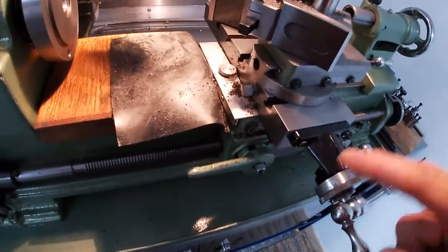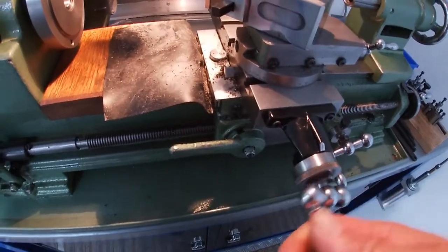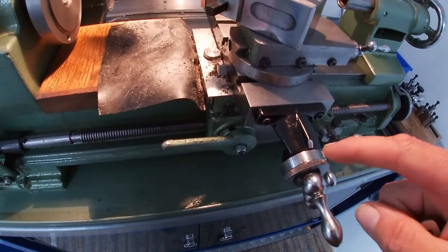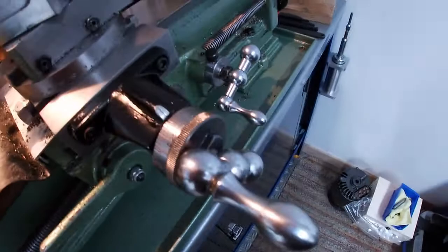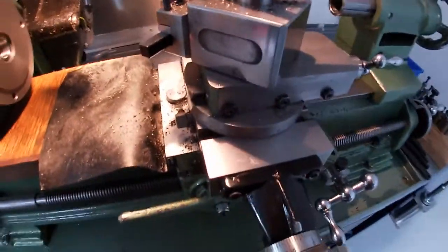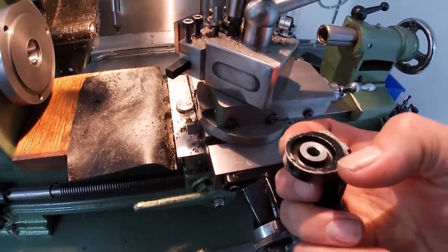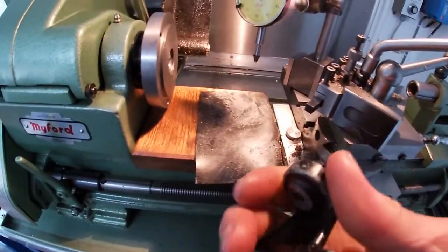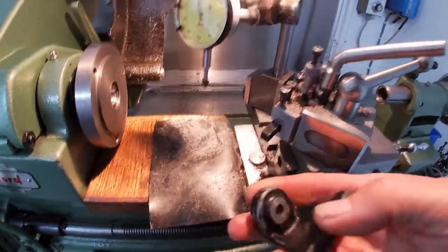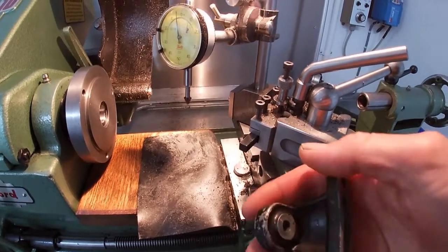So I stuck with that and liked the look anyway, even though it needed a bit of tidying up. Now the issue with the backlash was this normally just bolts up through and there's a washer in there. I'll show you the condition of things that you get when you buy these from the supplier. See that — that's the surface where the screw is going and this is the back surface. Although I've been using it, you can see there is a little bit of wear on that, but the surface isn't actually flush.